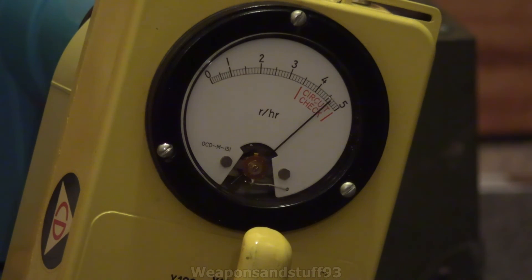Let's repeat that — about 4.5 that time, getting closer to 5. Repeating again, this time it's going pretty much off scale, so in theory that means 5 Roentgen. Let's put it on the x10 scale and see where it goes. We're now on the x10 scale, so 0 to 50 Roentgen. It reckons it's about 10 Roentgen, assuming that's correct. We've found where it's most accurate: 10 to 11 Roentgen.